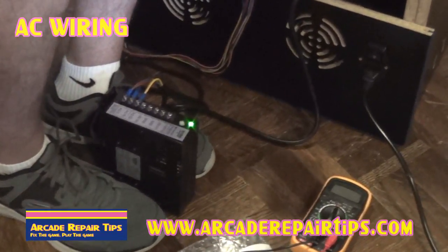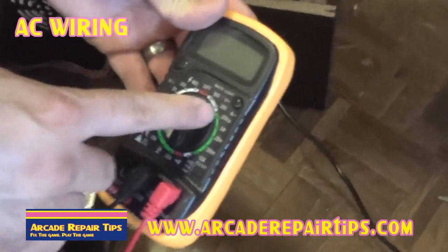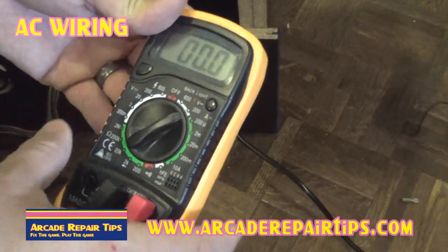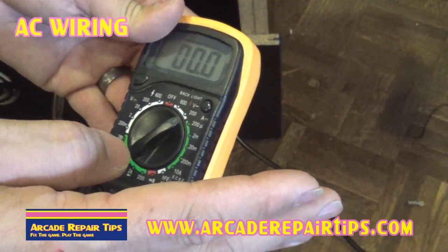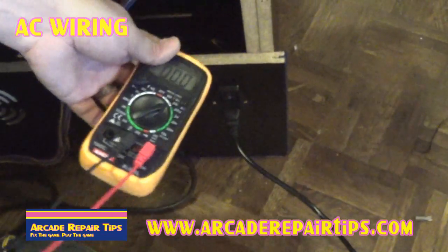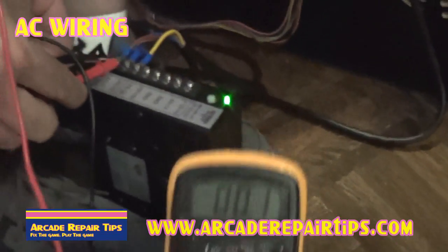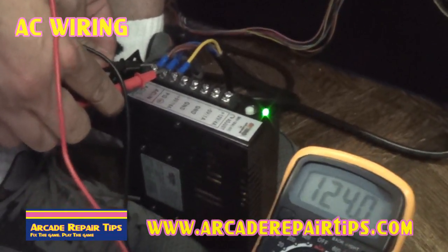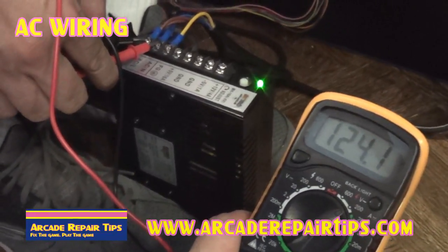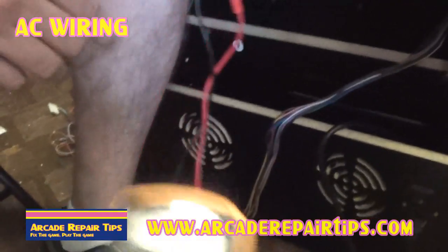Okay, we can also check that with the meter. Now, if you got the same meter from Holland Computers, we want to check the AC voltage, and that's over here. We're going to turn it to this 200. You always want to go higher than the voltage that you want to check, to whatever the next level is. We don't need 600, 200 is close enough because it's 120 volts coming in from the wall. So now if we check this, we should get around 120. We're at 124. Somewhere from 115 to 125 is fine. That's in the range that we're okay. Now we need to check the DC voltage.